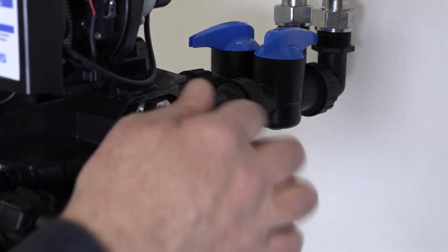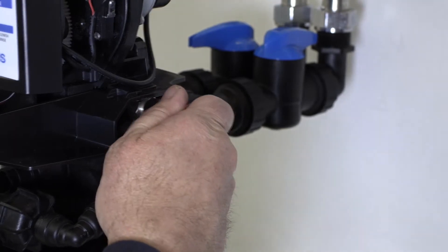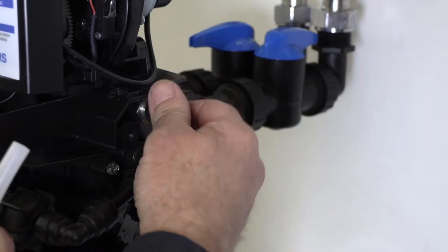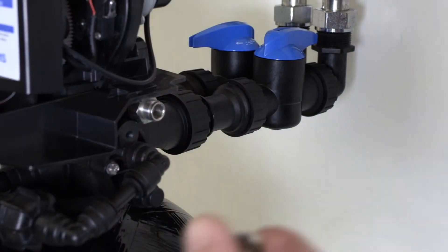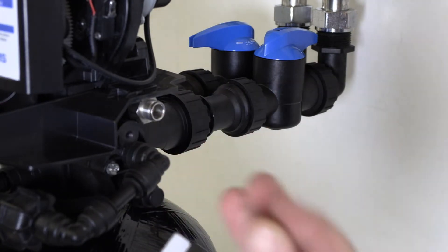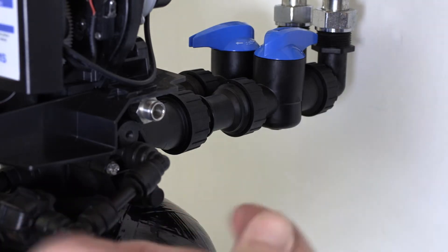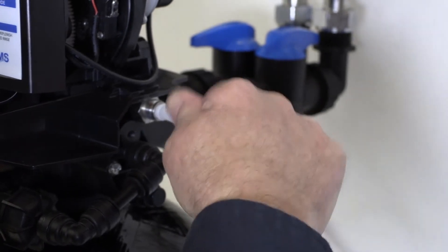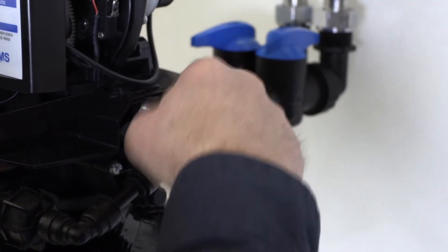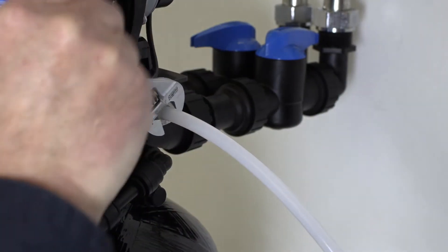The other end of the tube is going to the side of the valve here. This is a black plastic piece — here's a stopper. We'll go ahead and loosen this compression fitting and pull this plug out. Now we'll install the compression fitting: put your B nut on here, take your compression fitting — the taper side facing the end of the tube — give yourself a little room, press it in all the way, then thread this on and tighten.